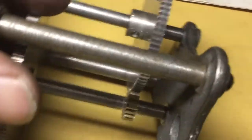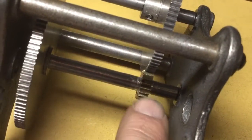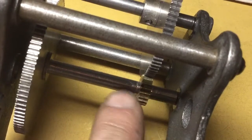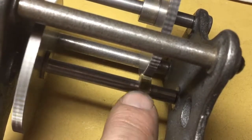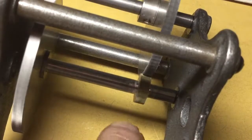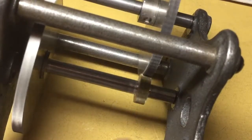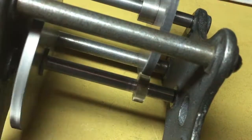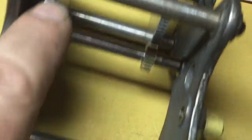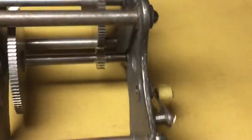These pinions are available from suppliers, made wider with a set screw as a repair item. But as you can see, it's very possible with a little bit of patience and some solder to repair them and have a pretty good repair.